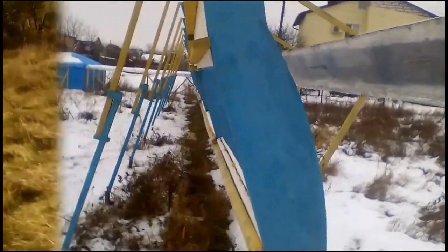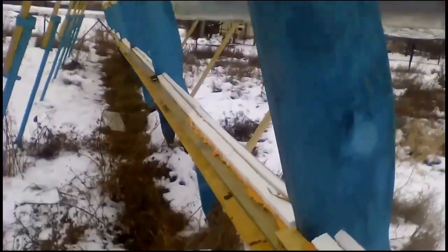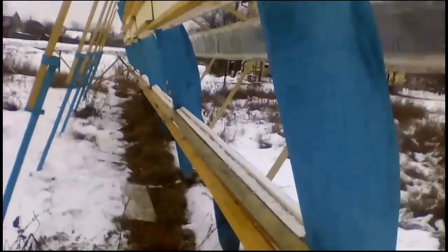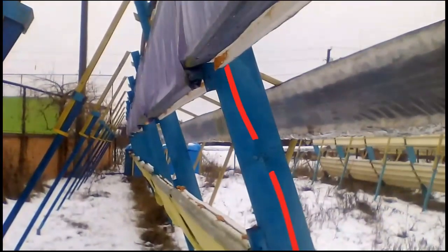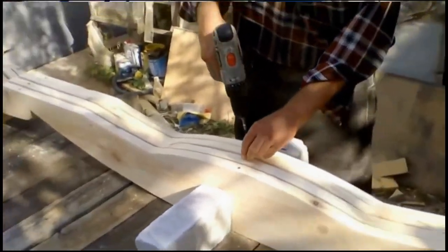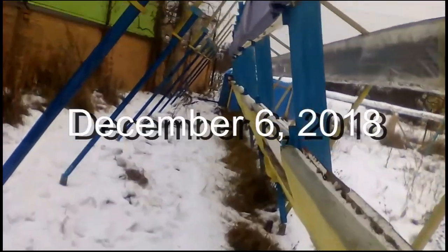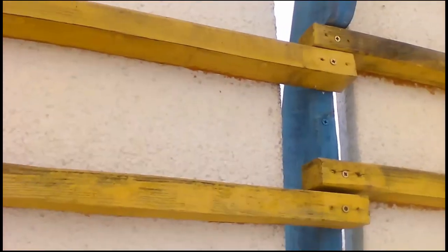This is the levers of my second row, and now we can see their condition after two years of operation. My levers are made from Ukrainian pine, but it is obvious that we can make them from various metal profiles, or they can be made by a factory from thin steel sheet by means of stamping and welding. The levers of my first row have a different design, and sometimes we can see such cracks of their wood. That is why I install such screws which must resist cracking the wood. We can see that only some of the levers of my first row have cracks after four years of their operation, although these levers were made from poorly dried wood. Now I am showing the fixing of those battens of my platforms to the levers of the first row, and the battens were fixed with screws to these wooden blocks, but now I think that it was a bad technical solution because we can see such cracks. That is why my second row uses a different type of fixation when the battens are fixed with screws to wood of the levers.